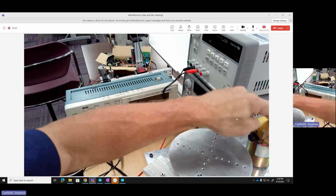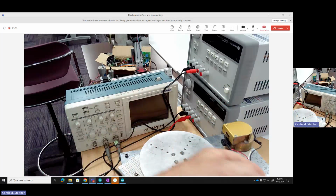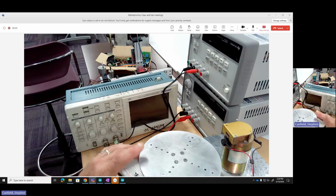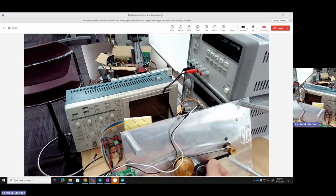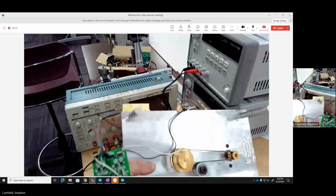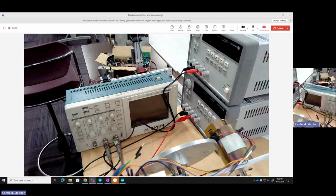I've got a brushed DC motor in the back. You can see it's brushed. It's a DC motor, brushed because it's got two leads. It's got an encoder at the top, but I'm not using that. We flip underneath. A nice little timing belt drive system runs over this little tensioner to a pulley that runs the big disc up on top. Have a nice little constructed thing.